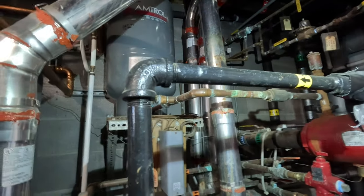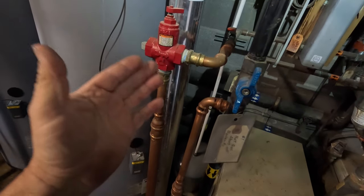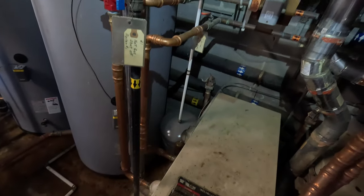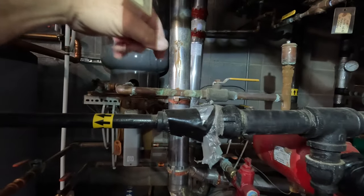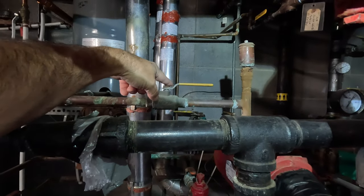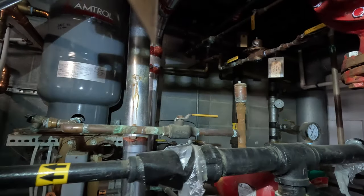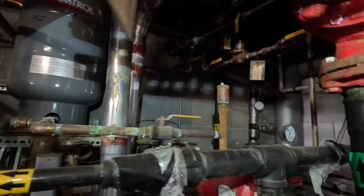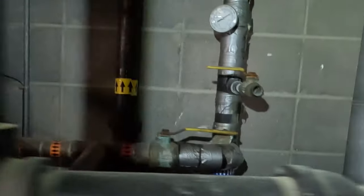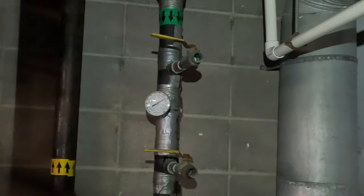Here's another expansion tank for the actual boiler. That one there is for the water heaters - basically a shock arrestor going to the sinks. This one here is for the actual boilers. Once again, ball valve - when you have a ball valve, my feeling is you should always take the handle off so it's not accidentally closed by people that don't have a clue. This auto bleed here is obviously closed and cranked down with a pair of pliers - it should just be a manual bleed. There's also stuff here where if somebody hits that, it's going to blow hot water in their face.